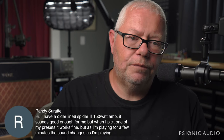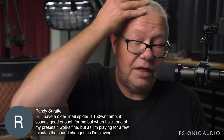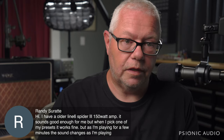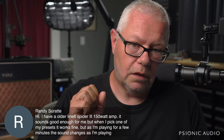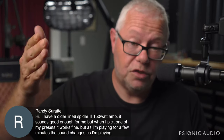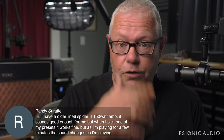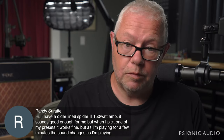Hey, Randy, on the old Line 6 Spiders, they change presets and they change settings based on a control voltage. And as those things get older and older, the capacitors in the power supply begin to have issues. And that control voltage can have spikes and fluctuations, which makes all the chips which react to changes in that 5 volt supply think they're being told to change channels or turn down the treble or turn up the reverb. So they do. It's a ghost in the machine.